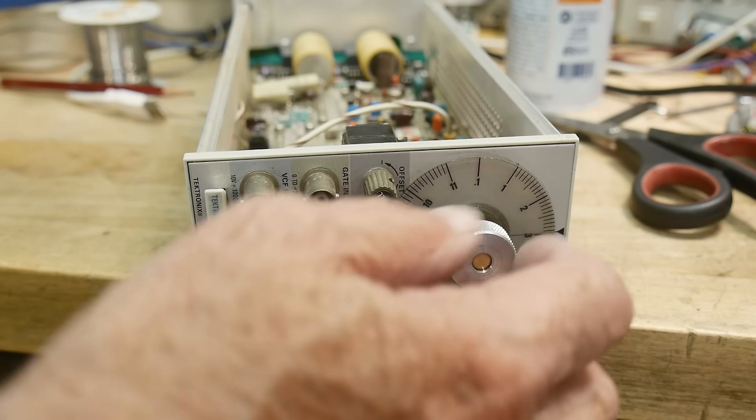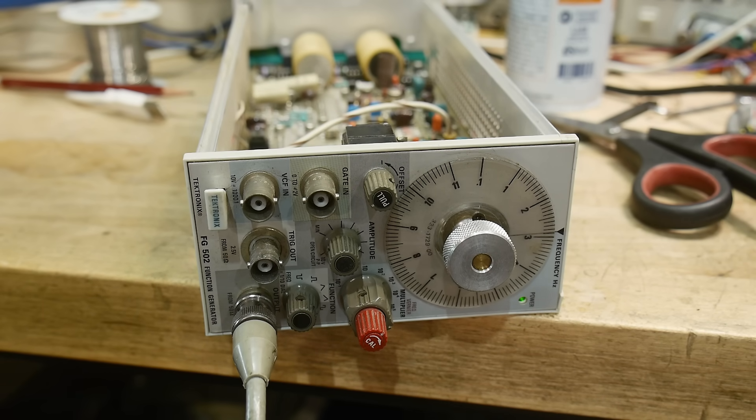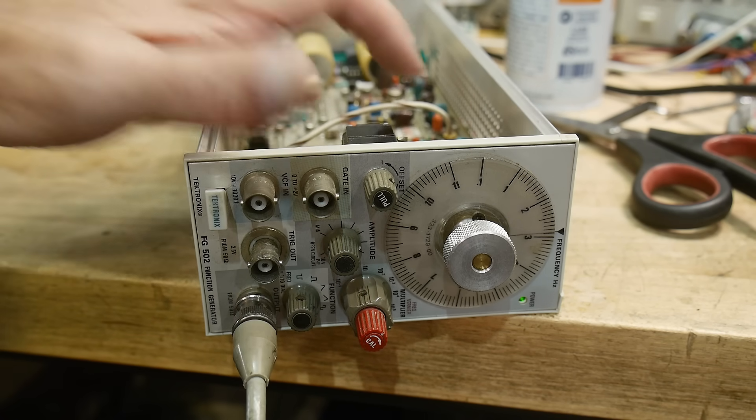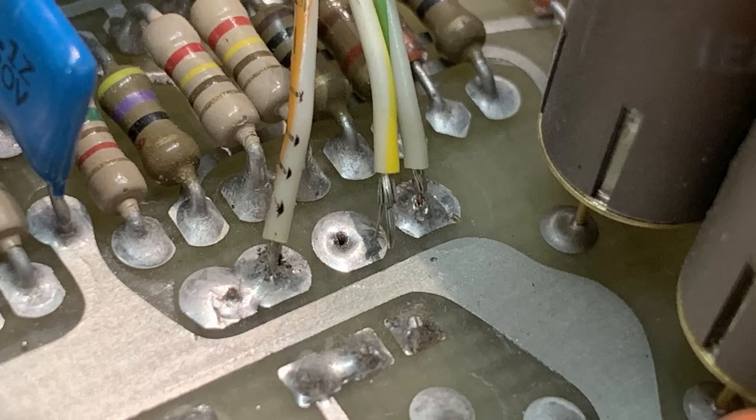I already found one problem. I was twiddling the knob and it was erratic - I couldn't quite figure out why it was sometimes not working. You can go around and tap things to see if anything was doing something, and this thing runs a potentiometer in the back. I tapped it and it seemed flaky. It's kind of a sealed potentiometer you can't really clean, so I figured maybe I could get a new one. I started looking at the PC board and the center wiper was just laying on the contact - the solder was so cold it had pulled out of its own connection and was just making an intermittent contact.